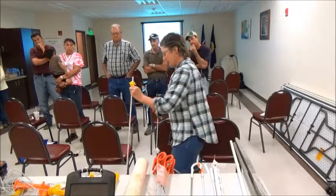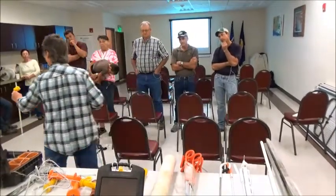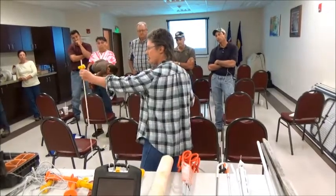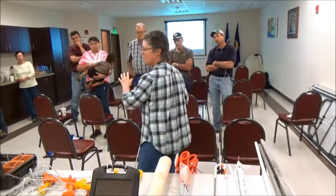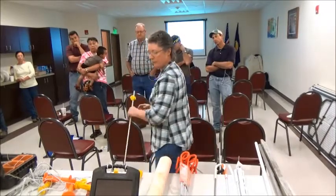To a deer running at 30 miles an hour, it'll duck under this and it won't duck under that. That being said, what I typically do is I have like 3 or 4 or 5 of these posts and then 1 of these posts. Because when something does hit that, it'll pop all the insulators off, but it won't pop that. And so your fence is only like 100 feet away instead of 1,000 feet away because they've carried it away with them.